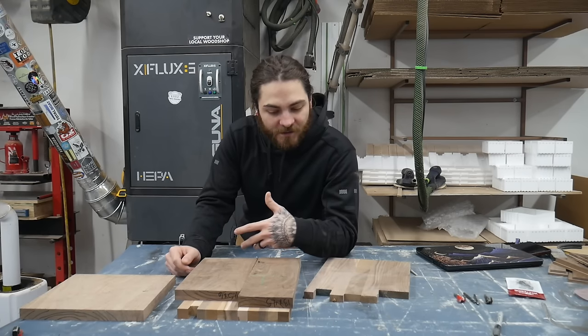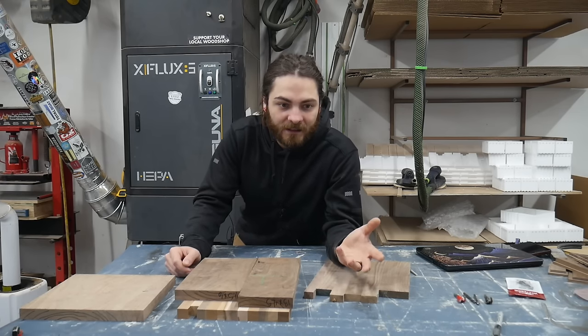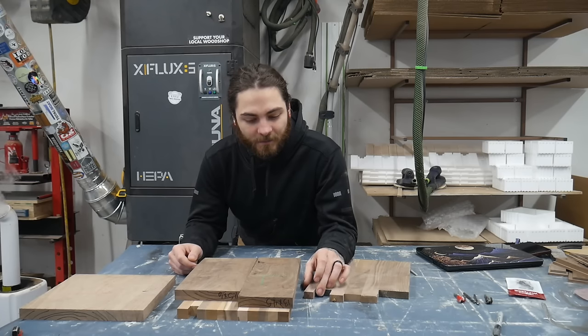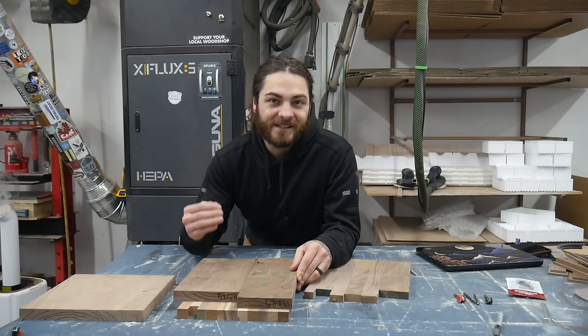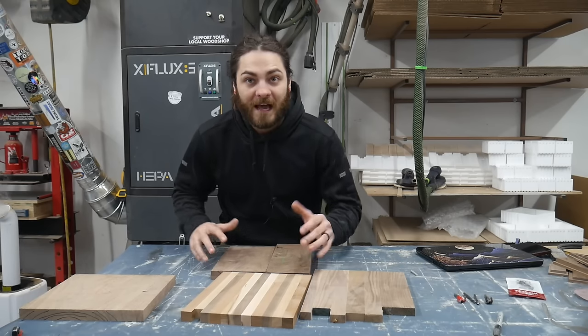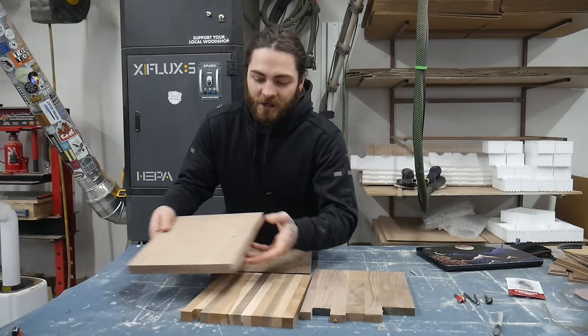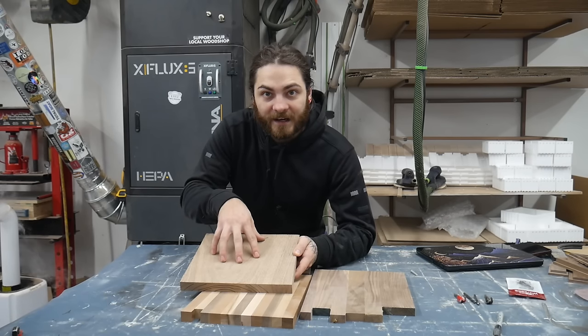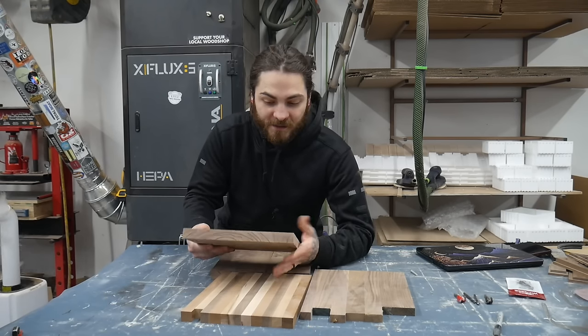You could go ahead and use something like pine or cedar, but I wouldn't quite recommend that, because the wood is so soft and it's really easy to dent, and it's more likely to warp as it's not so dense. Another major problem people have with catch-all trays is you're removing a bunch of surface area from one side, and odds are in the next day or two that board is gonna warp.